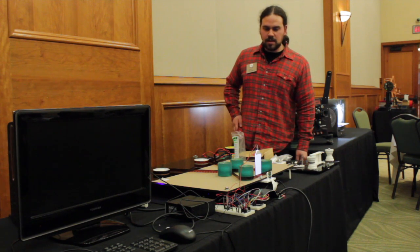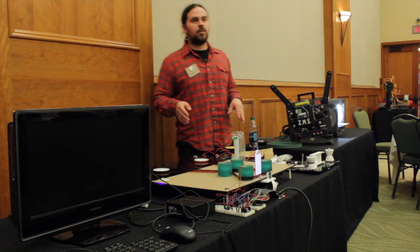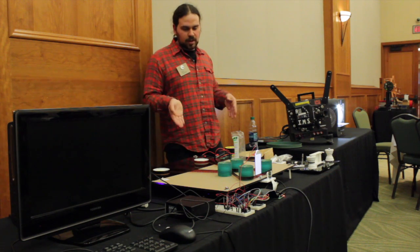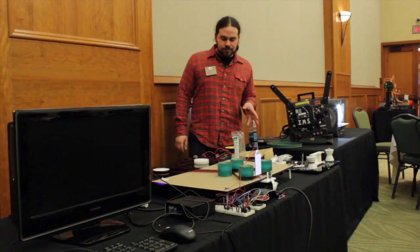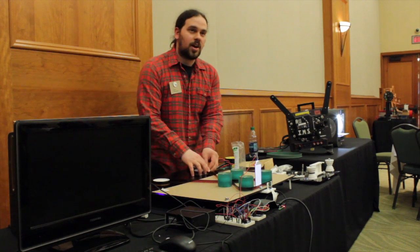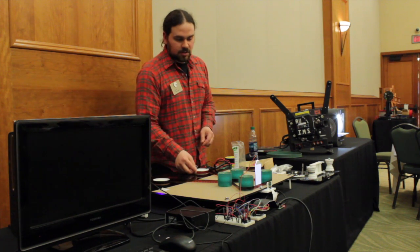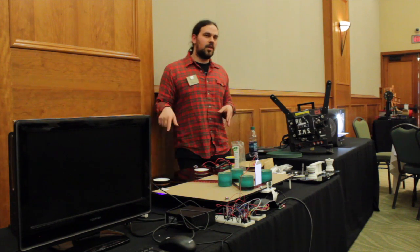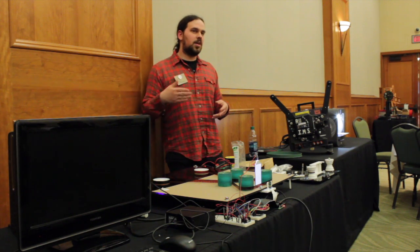So essentially, the way that we have the scanner working, and I've sped up the transport just so you can see it moving through, but it's actually really slow. The problem was that, because it's motion picture film, we need to be able to get every frame. So we had a couple of different ideas where we would set up some sort of tripwire to shine through the perforations and try to detect them that way. But definitely the most successful thing is just moving the film along and doing a low-res capture, and then detecting the perforations. When you detect 2 perforations, you then save out the high-resolution 2K file.